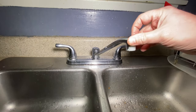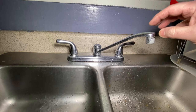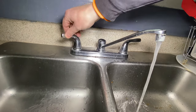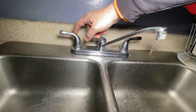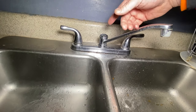All right, here's what we're looking at. This is a two-handle AquaSource kitchen faucet, and the hot side, you can see, is bad. It barely shuts off in one position. So we're going to get this fixed. This is where our culprit is. We need to shut the water off and then we need to pop this apart.